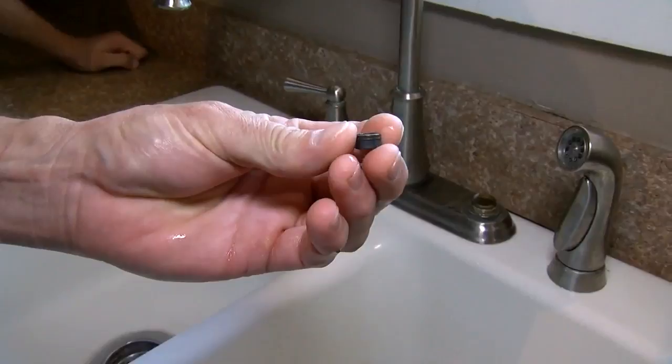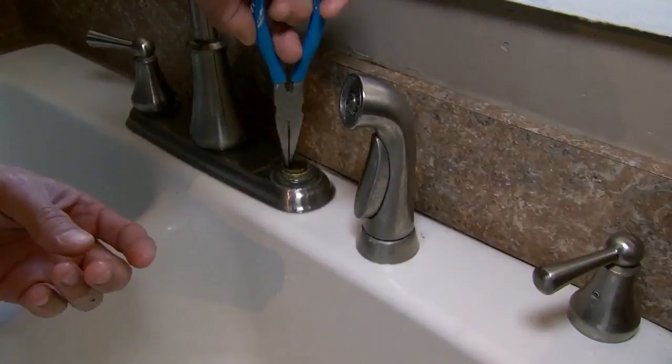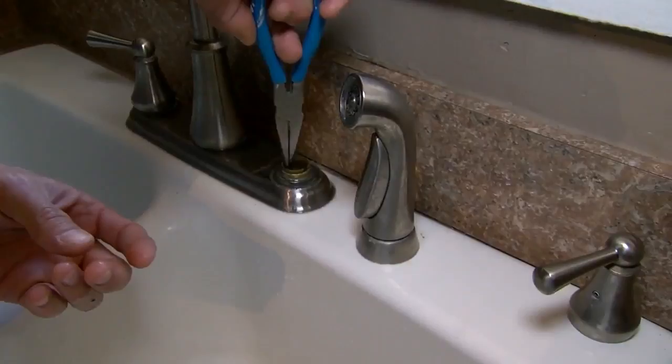Use pliers to find this — this is a rubber gasket. If these two surfaces aren't perfect, the water is going to leak no matter what. The gasket is worn down and so is the cartridge. Also, there's a spring below everything. Use the kit and replace all three items: spring, then gasket, then the valve.